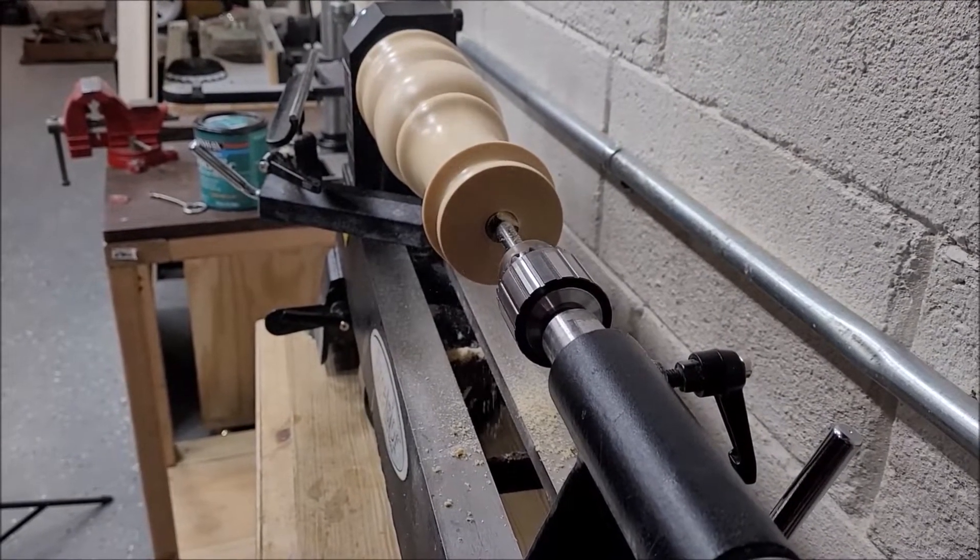It's a good six-foot-long cord, so plenty of room to get it plugged in across the room. You can see the Forstner bit hole — it sits in nicely. While he put the super glue on, I sprayed some activator into the lamp. With plastic, you want to move fast. We pulled the slack out and in real time you can see how quickly that glue sets once you put the activator — you don't need much pressure, and within ten seconds it was completely secure.